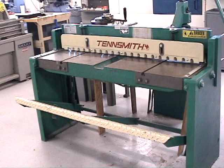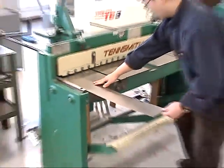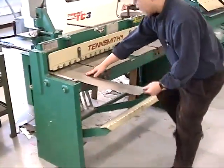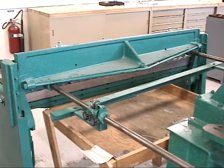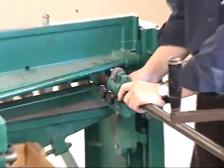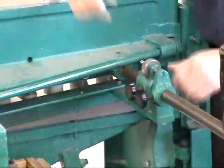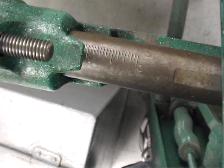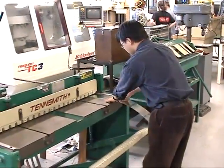The cutting is done on a simple treadle shear operated manually. The cut width is determined by the location of the back gauge, which can be set using the graduations on the gauge. Note that these can resolve to only about 1/16 of an inch, and sighting errors are likely to happen. The sheet is inserted into the shear as shown and pushed into contact with the back gauge.